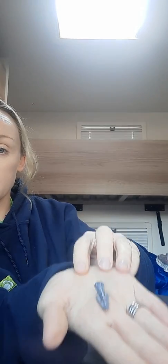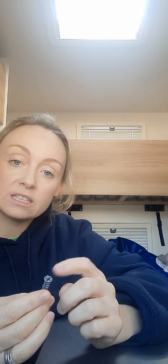So I think this is the one we all kind of recognize. You can see this one with its little wings here. So the idea is you grab a drill bit that will match the size of this. It usually says on them what size they are. And then you drill the hole in the plasterboard and you pop that in.